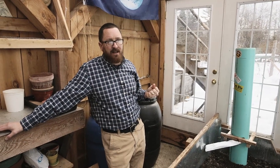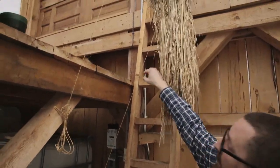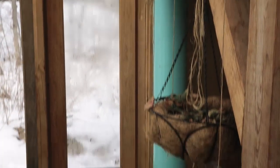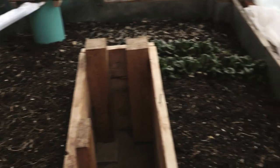One of the things you find with a greenhouse is that you can get excess heat pretty quickly if the sun's out. What we've created is something we call a climate battery. There's a thermostat down here closer to where the plants are and a thermostat way up at the top. The thermostat will trigger a fan at the top of that green pipe and it will draw that excess warm air down through that green pipe, blowing it in through those little holes into the sand below our feet, and then it exhausts out cooler. The whole idea is you take excess heat during the day and you bank it like a battery — bank it in the ground. This gives you a way of extending the season using a passive system that's all powered by solar panels on the roof.